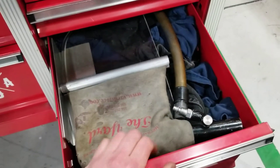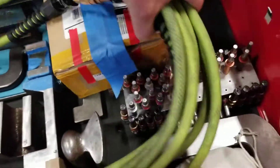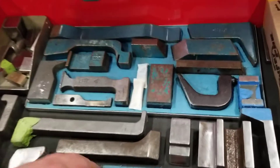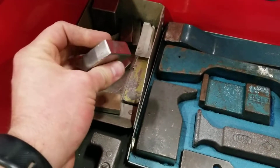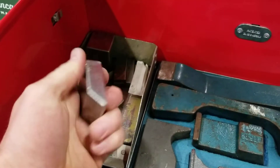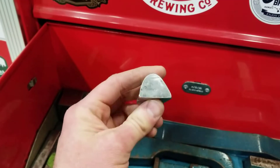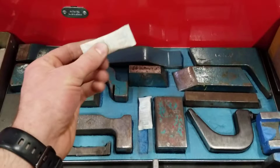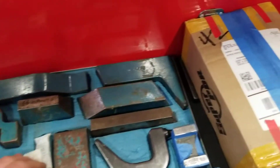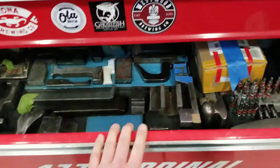And then just the air back, which every structures mechanic is definitely going to need. This is my bucking bar drawer. I keep all my tungsten here. If you're a structures mechanic or looking to be one, having tungsten is a priceless item. These are quite a bit denser and they work really well. You can get them from tungstenbuckingbar.com or the yard store has a bunch. A lot of old guys will have flap weights or control surface weights that are either depleted uranium or tungsten — they work really well. I usually keep some desiccants in here to keep the bars from rusting. This drawer probably weighs 100 pounds or so.